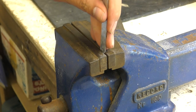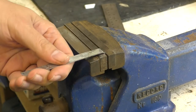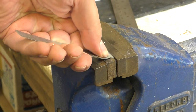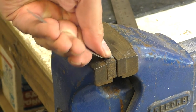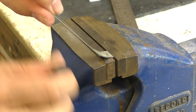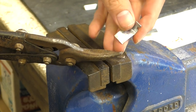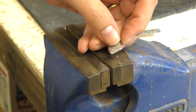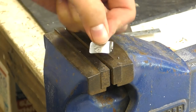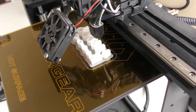Then you stick it back in the vise and bend it 90 degrees. A hammer helps to get a sharper corner. Then you bend it upwards — the amount of bend is determined by the size of the airframe you're fitting it to; it's easy enough to bend into shape. Then you trim off the excess and again round off all sharp edges. That's the bracket done.